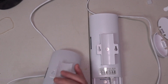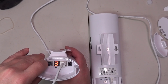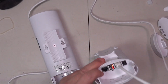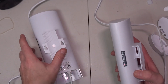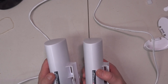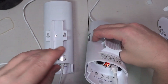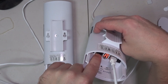We're going to put these on channel C and go with channel A — and change this one over to A as well. There we go. On the sides you're going to see power indicators, and pretty soon you'll see them connect. You can see we're getting signal now. All we have to do is connect our internet source here, connect our Wi-Fi router here, and we will be receiving Wi-Fi at a distance.